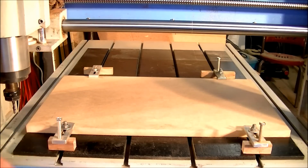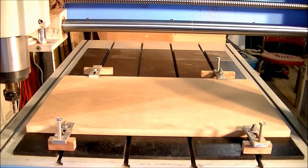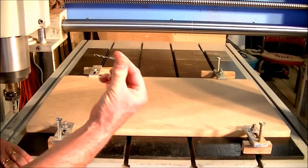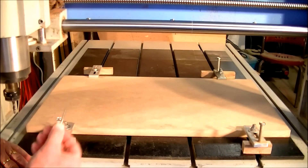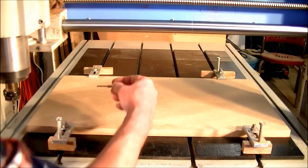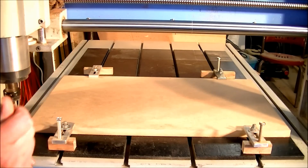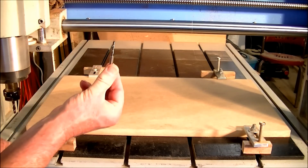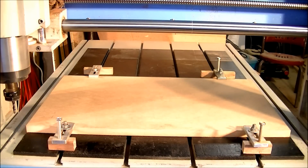They're pretty tough but they're not that tough. So what I do is I do a few runs with the 6mm to make a good trough, then sometimes I'll put the 3mm in and cut the picture with just one cut. Other times I'll do a full roughing cut with the 6mm ball mill and then put the 3mm in after it. I just want to see how the material is going to cut and we'll make a decision then.